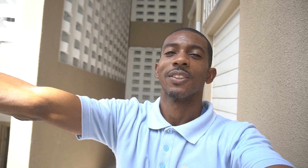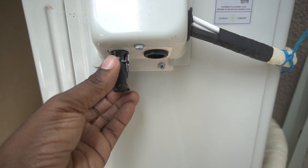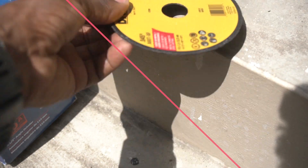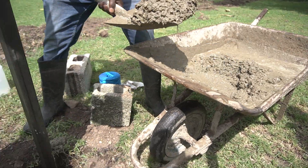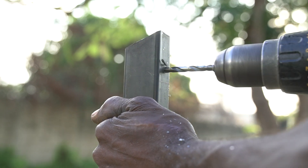It's a totally brand new day. Our hollow sections are now being prepared to mount the solar panels. We've also completed this pipe — it will be carrying the cables from where the solar panels are going to be placed. The cables will come up here and terminate on these MC4 ports, which are direct connections into the solar panels.